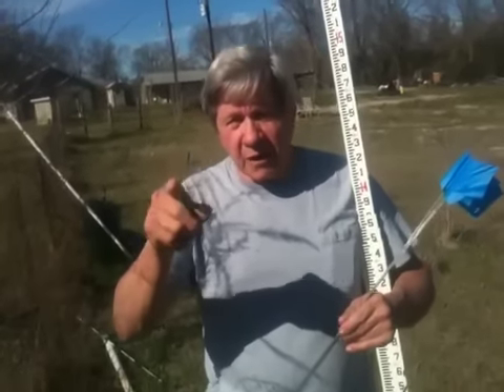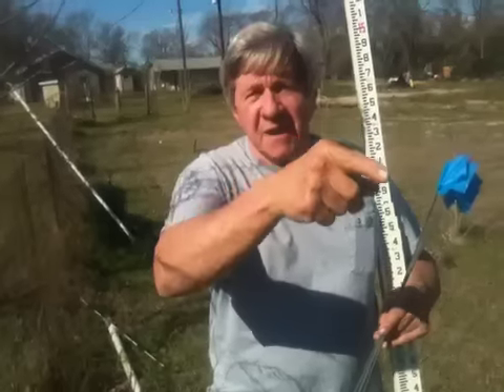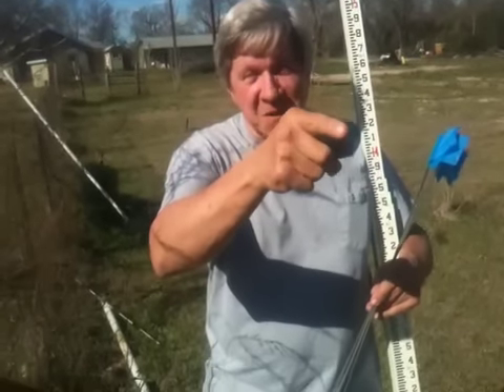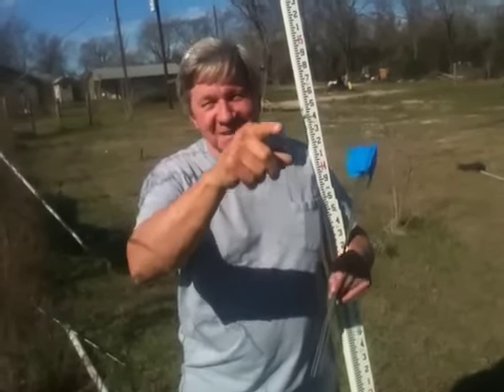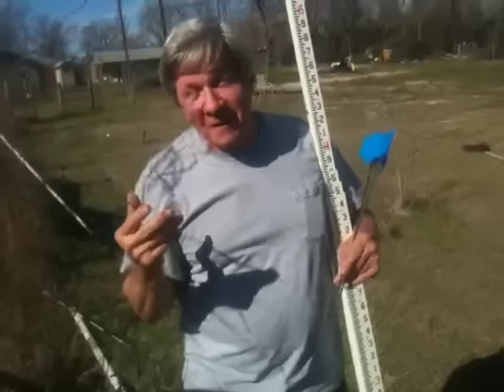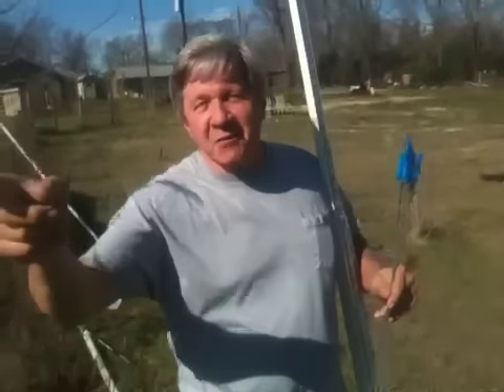This road goes across the contour and is uniformly 2%. This road does not exceed 2%, except one place where it's 3% — and that's the release point for all the water that catches on the road. And that's where I have to do all the maintenance and erosion. I got punished for it, but it's a great teaching point. Because I've got a 2% slope, this road is very easy to put in once you get your contours out.